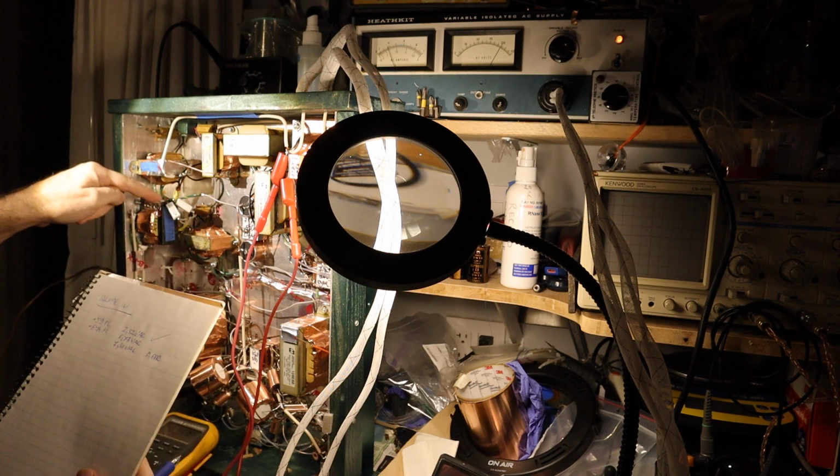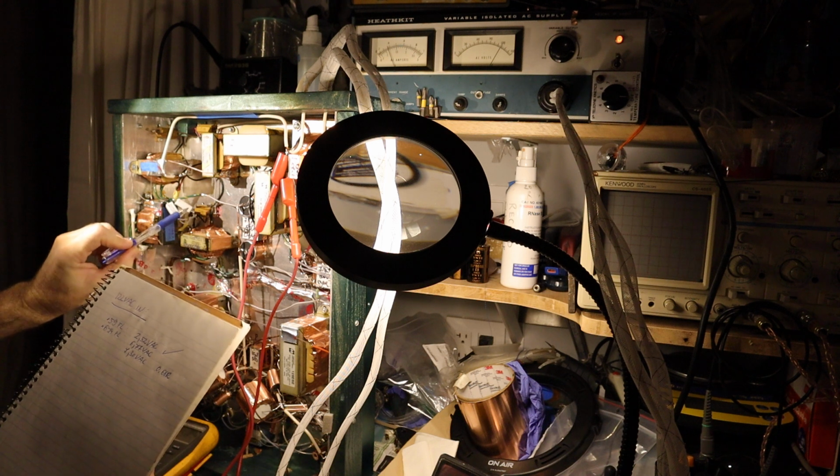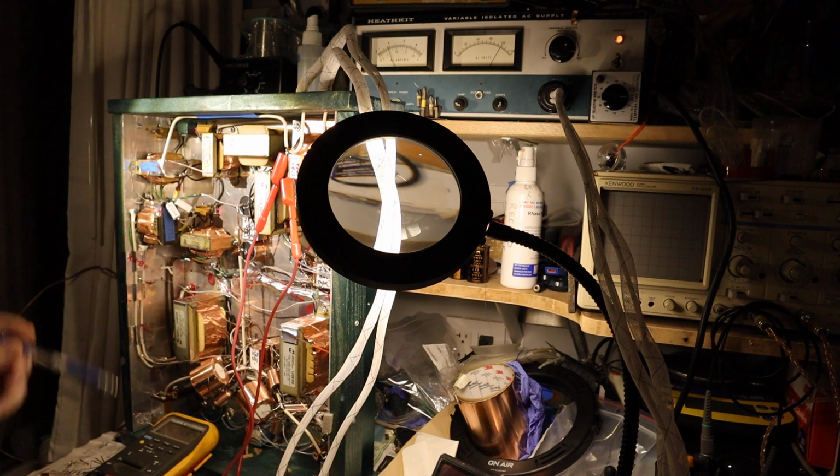So we had here 7.3 volts, and after the resistors we had 6.77 volts. So let's just turn on our mighty calculator and calculate 7.3 minus 6.77, and that's 0.53. So this 0.66 ohms drops us 0.53 volts, right?